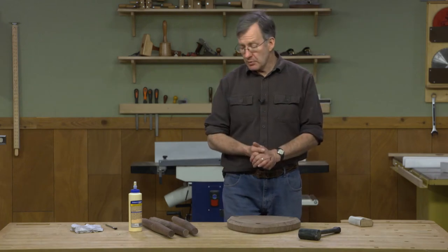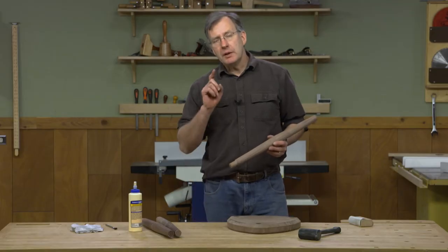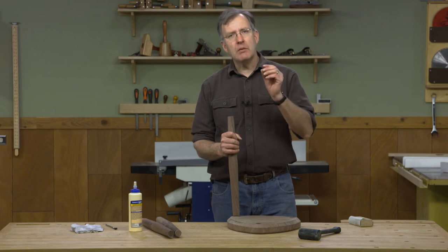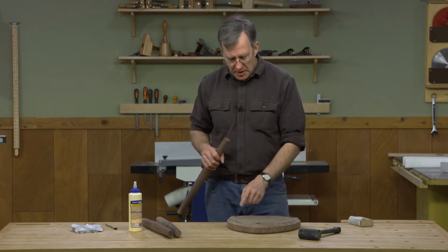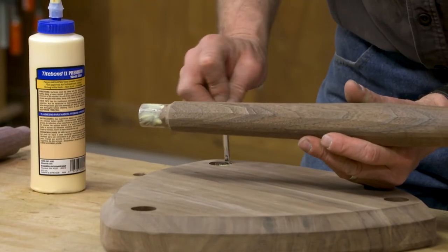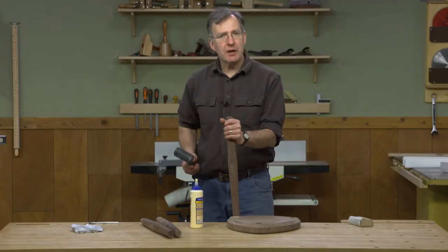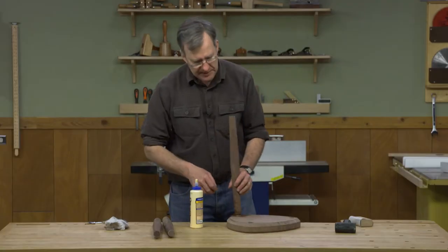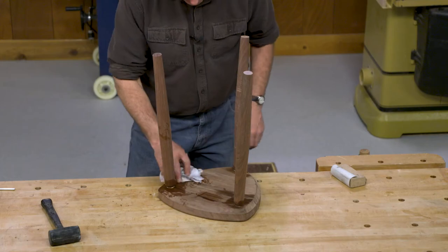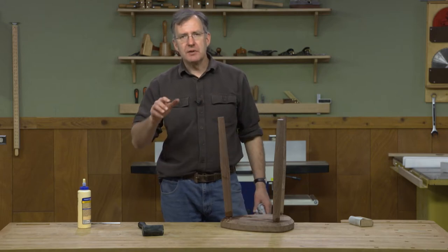It's time to glue up our stool. All the usual rules apply - we want to apply glue to both the tenon and into the mortise. One important thing: make sure your tenons are a nice easy fit - not sloppy, but not tight. When the glue is applied you don't want to have to pound them in, because if they're too tight we really run the risk of splitting our seat. I'll give each one a little tap to make sure it's bottomed out, and since it's one leg at a time we can take our time. Then it's time to let things dry and level our legs so the stool is nice and flat on the floor.